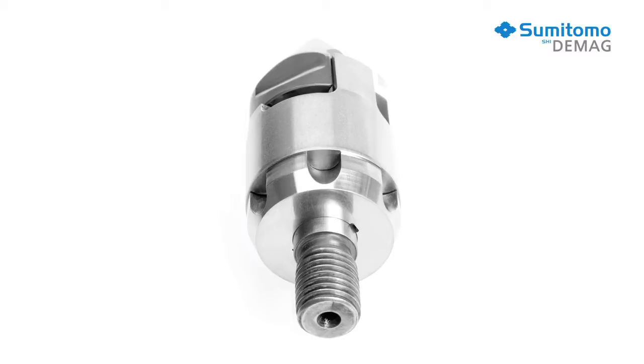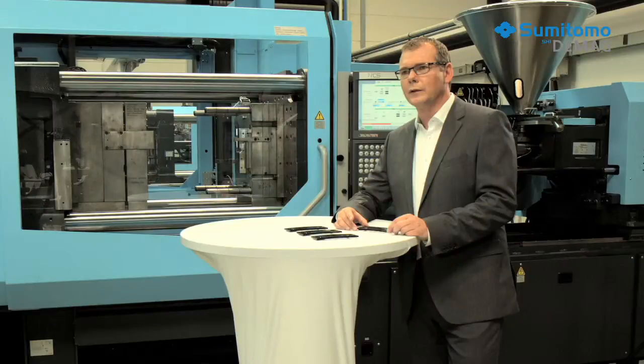When we produced this part, our project partner Stieler GmbH helped us fit the Intellect 50 with the right equipment so we could meet the customer's needs. We fitted a lockable non-return valve to the Intellect and added different functions for better process control and visualisation. The machine produced the faceplates in a very accurate injection moulding process, using external gas pressure technique and cyclical cavity temperature control.